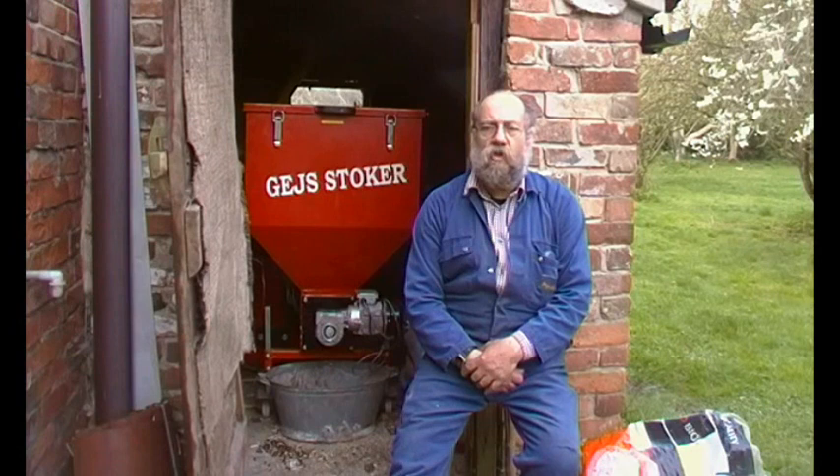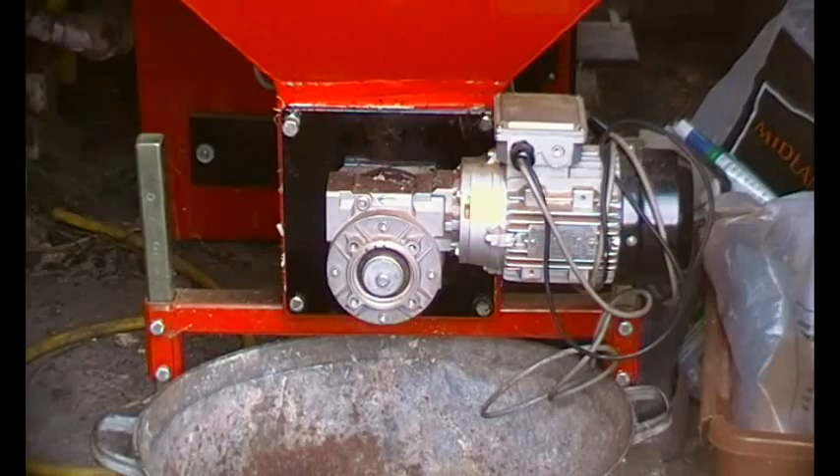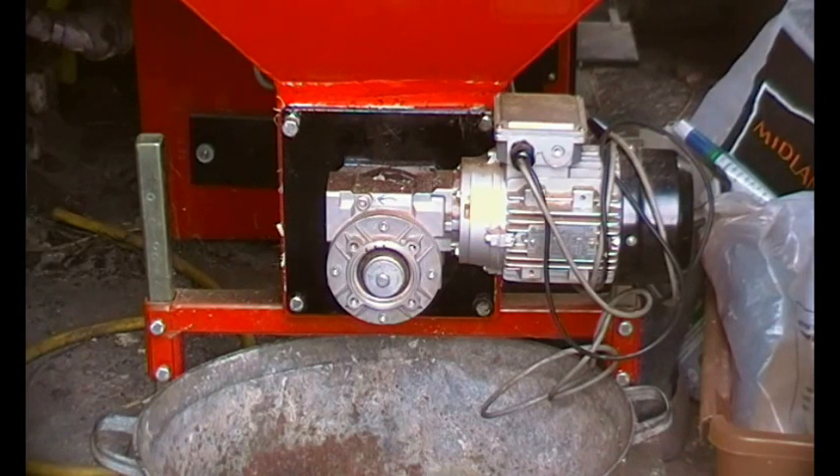The thing to do here is I'll show you the symptoms and then I'm going to have the whole gearbox and auger assembly off the stoker. You can hear something was wrong — it drove for half a second and then stopped again. It could be that some of the pinion teeth have worn away, so it just about grips, moves round, then gets round to the worn bit again.